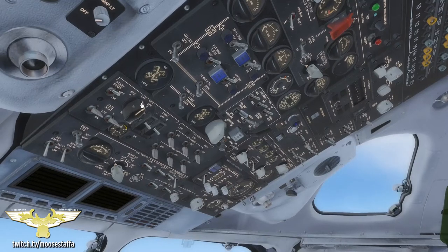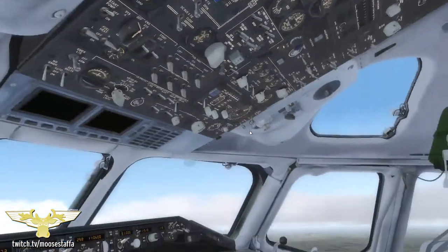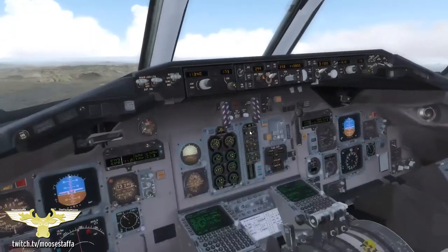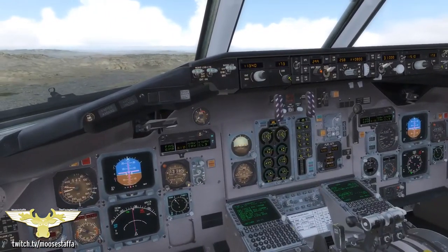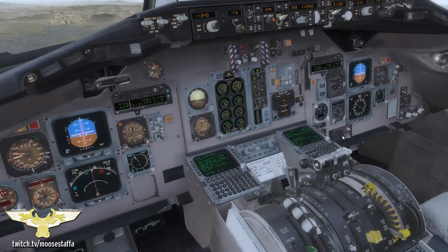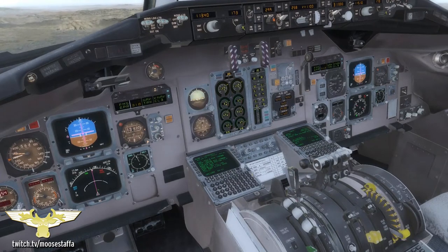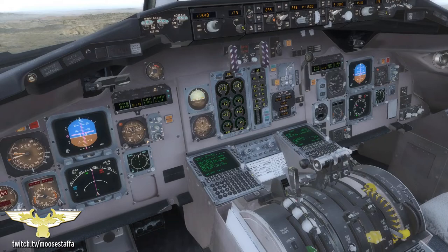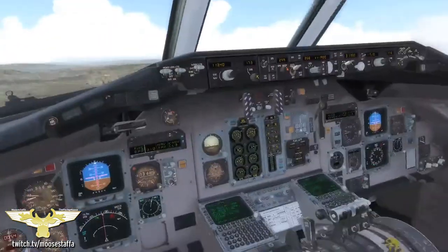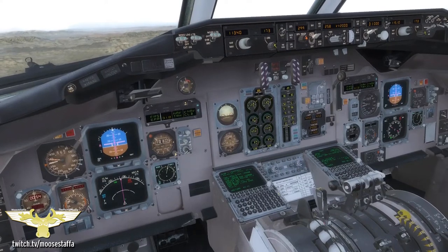We can turn the ignition system back to off. And I'm trying to think about missing anything on there. That's why we do the checklist here. So, looking at the after takeoff checklist, brake temperatures, we didn't have any real braking action, so we didn't really have to worry about that. But landing gear is up, lights out, auto brake is off, speed brake lever is retracted, flap and slat levers are up and retracted, engine ignition selector is off, center fuel tank pump, we're going to leave it on for right now. Eventually it will burn down first and we'll have to turn that off, we'll get a warning in flight to do that, and altimeters will reset to standard when we get past 18,000 feet.